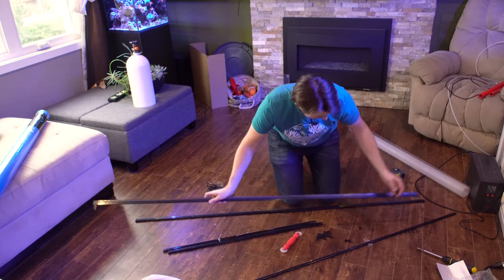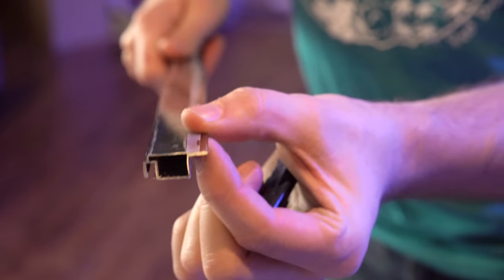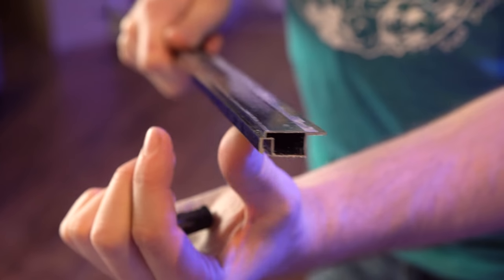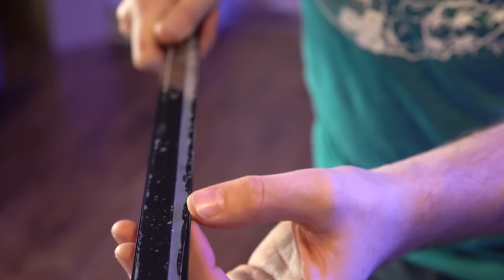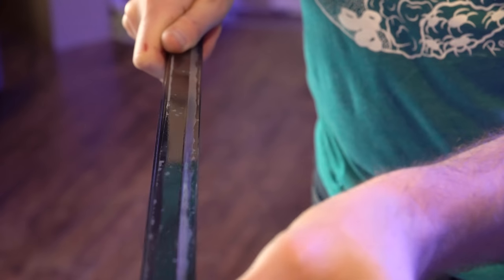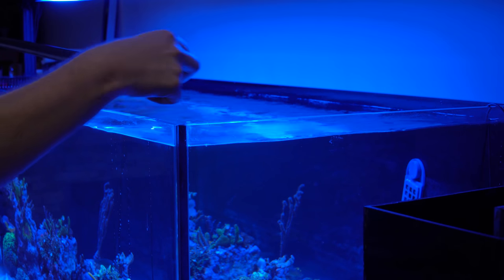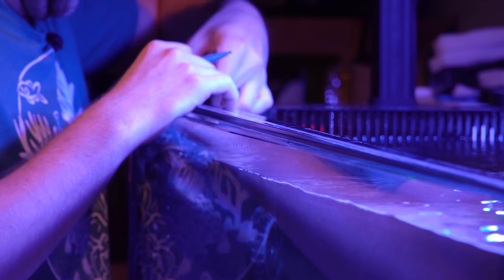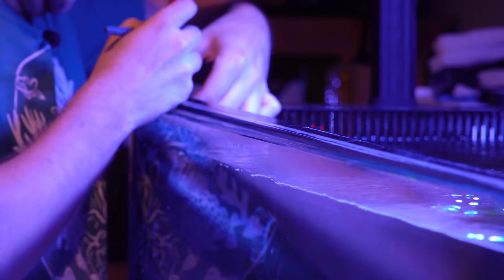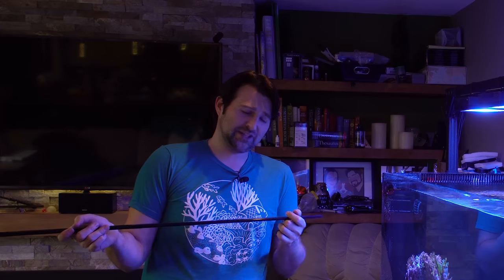To assemble, just take these corners and push them in. If we take a look at the profile, there actually is a lip on this. The lip is going to sit on the glass and the spline material goes in the center. We just slide our corners in like so, and that lip goes all the way around and sits on the edge of our tank. There's a little plastic protective coating on it, so that white piece just protects it from getting scratched — we'll peel that off once it's assembled. I'll set it on the lip to figure approximately where it's going to go, then cut the rail on the miter saw for a nice perfect cut. Make sure that little flange is on the outside, pop the corners in, and we test fit one side.